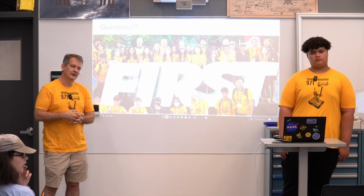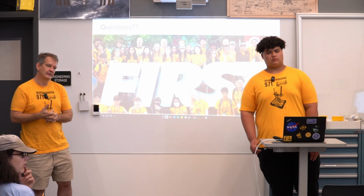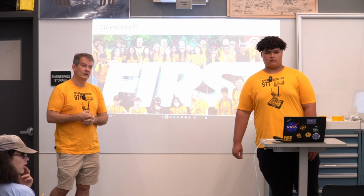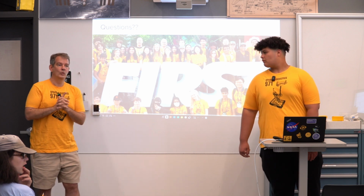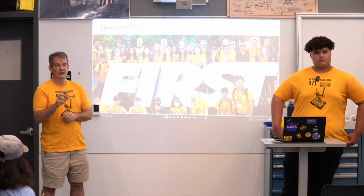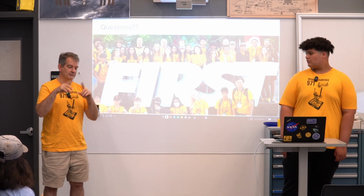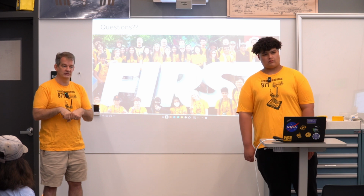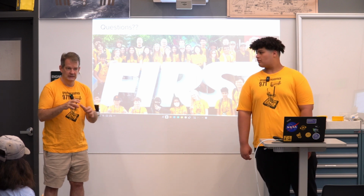Yeah, I was more wondering, because you would logically see multiple tags in the field. How are you fusing this to a single vision estimate before you fuse that with your drivetrain methodology? We are not. So the question was, how do you take multiple tag estimates and fuse them together before you feed it into the drivetrain estimate, I think, right?